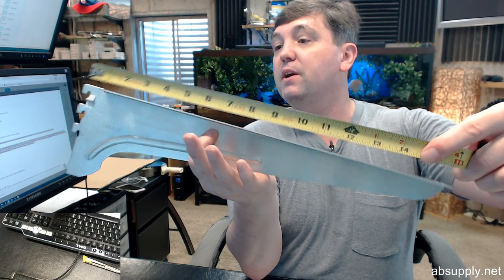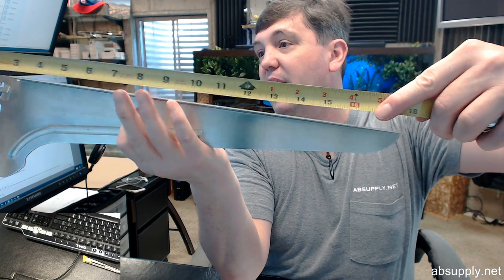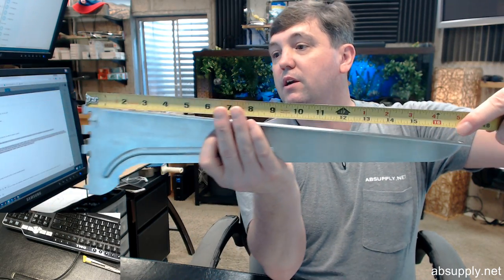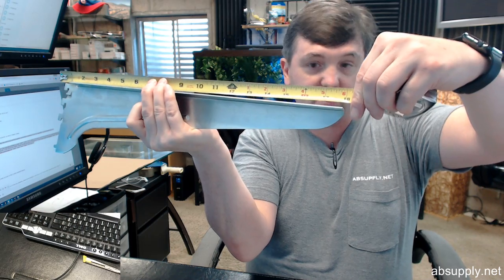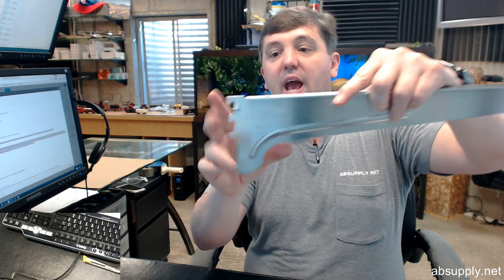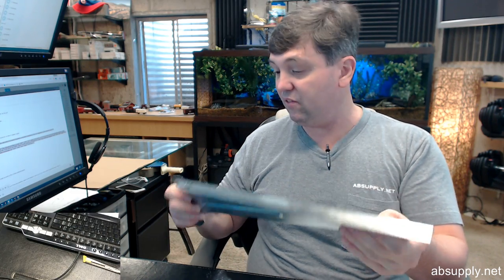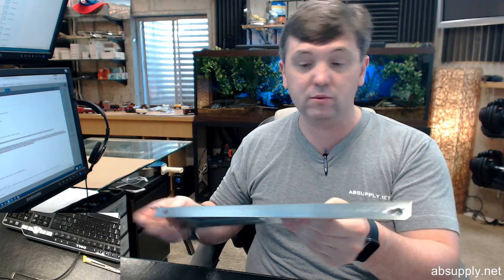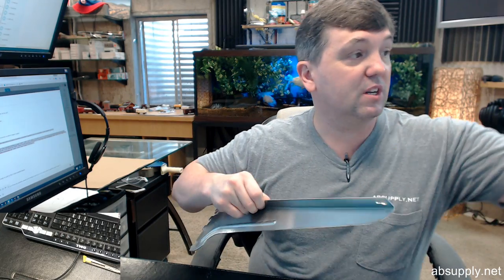Now, 18-inch, that's going to be a reference to basically the face of the standard to the edge of the bracket. And that's going to be somewhere down here where the unit is going to, of course, engage into the bracket itself. So that's going to fit into the bracket, and you're going to have an overall dimension of the unit of 18-inch. The usable size is probably closer to about 17.5. This unit weighs 1.18 pounds, so it's quite heavy and substantial. It's made of steel. The Z, or the ZC in the part number, is going to tell you that it's in a zinc finish.